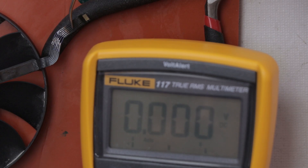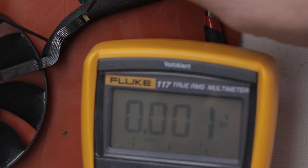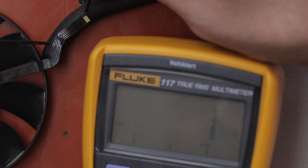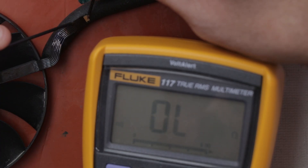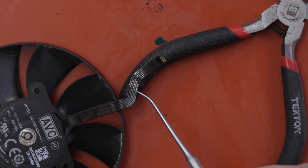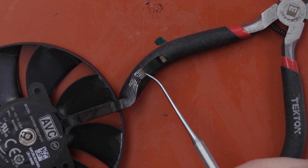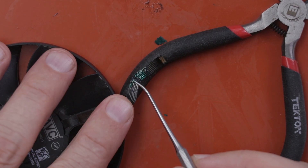Now I've got this entire ribbon cable rebuilt yet again, except with the connector part flipped around the correct way. Now I need to test and make sure there's continuity between each end on each of these pins — this will tell me whether my solder connections are good. Number one: good. Number two: good. Number three: good. Number four is good. And number five is also good. Now that I know each of these connections is good, I will add the solder mask to protect these joints and make sure this bare wire doesn't hit against any metal part and short out the circuit.